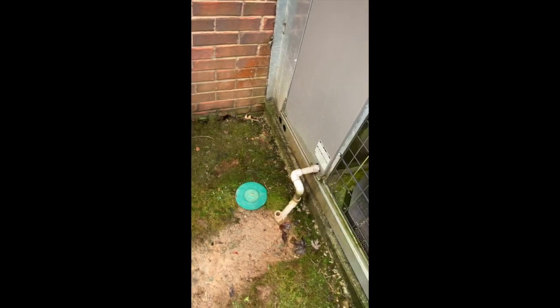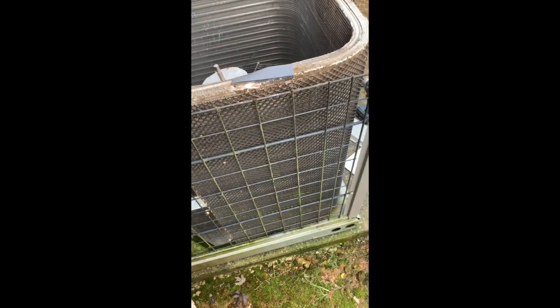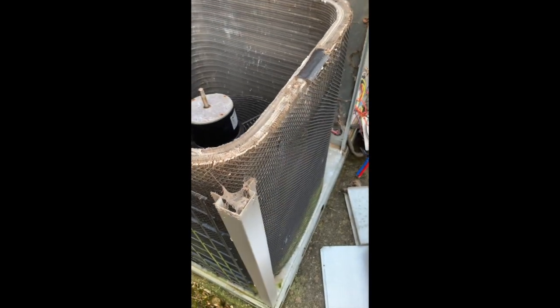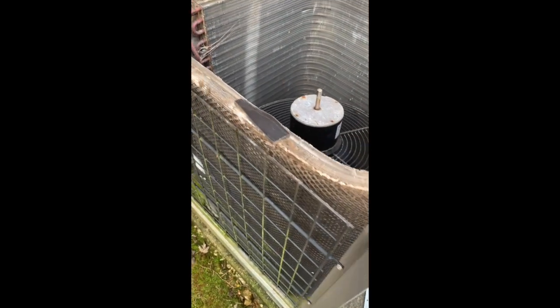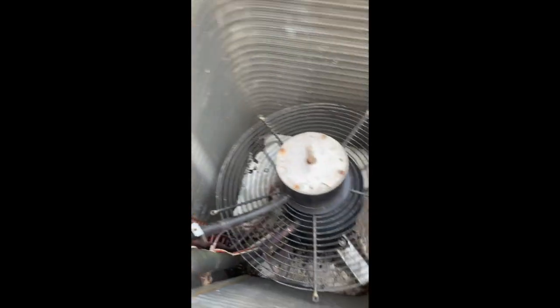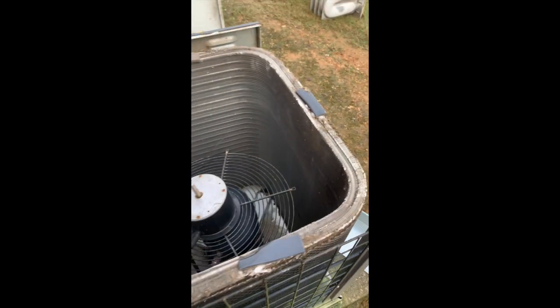Let me show you another thing. Anybody who works on stuff — we all hate engineers. This is your outdoor coil, your condenser coil. It's kind of important to keep that coil clean because if you don't, it greatly reduces the efficiency of your air conditioner. It makes it run longer, pulls more amps, uses more energy, and you don't get the cooling capacity out of it. This is a double thickness coil, which poses a restriction in itself.